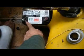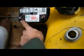We don't have a short circuit, so I'm going to turn the key off, remove the test light, and hook the battery back up. With the battery reconnected and ignition switch on, the generator light comes on. It tried to crank over, but now we have no generator light — so we've got a weak connection.